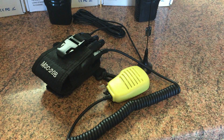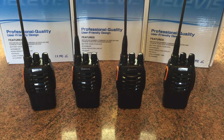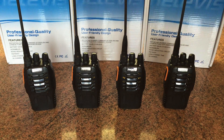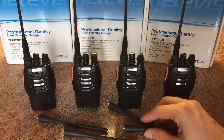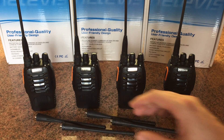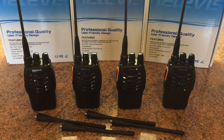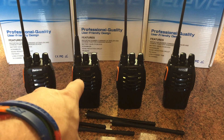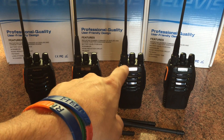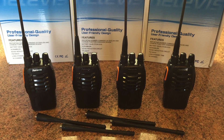All four of them there - £5 each, I just think it's an absolute bargain. I've put the different antennas on - I don't use the little stock antennas, they're just no good. A couple of mates who've had these radios have looked inside the antennas and they're not soldered right - they're actually faulty. I usually just swap them straight out. I've programmed them up: one for 70cm simplex, one for my local 70cm repeaters, one monitors local UHF communications, and one is monitoring PMR. They're all programmed up and all in use.